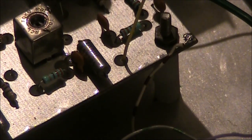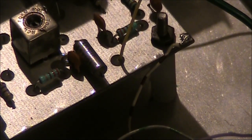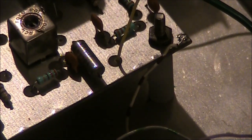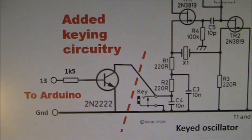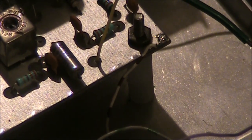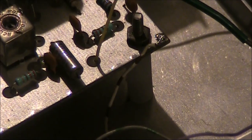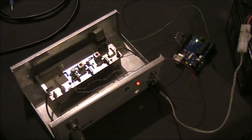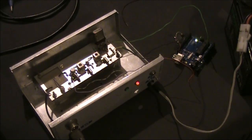The collector of that transistor connects to the keying circuit. The keying is done by shorting a part of the crystal oscillator circuit to ground. When current is allowed to flow through the transistor's base, that allows current to flow through the collector-emitter circuit, thus shorting this part of the circuit to ground. Even though it's keying the oscillator and it is on VHF, it sounds surprisingly good.